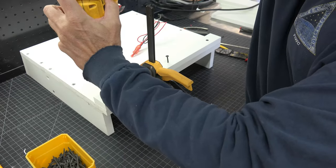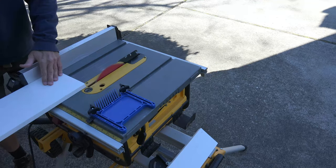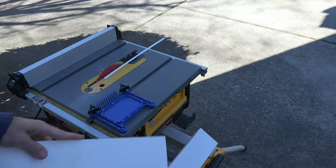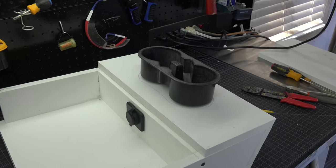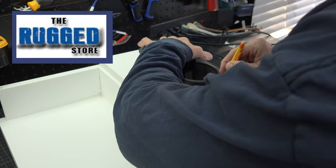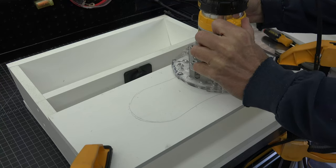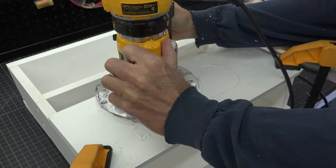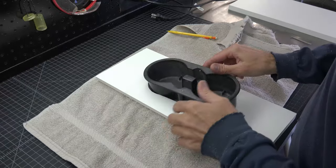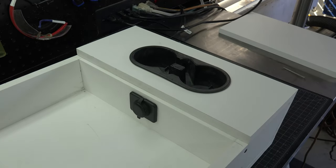The piece I am installing now is just a lip that houses the hinges and keeps them from undue stress when stepped upon — it actually locks the box in place. We are going to repeat the steps to make the top of the box, so let's skip that. The next step is to take your beer holder and trace out the perimeter with a pencil. I got this cup holder at the Rugged Store online — I just want to give them a shout out because they are an American-based company with great customer service and quality products. With a plunge router I simply cut out my stenciled lines. This stuff cuts like butter, so make sure you take your time and don't get ahead of yourself.